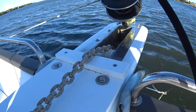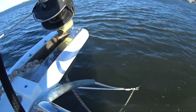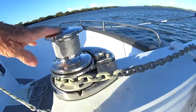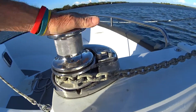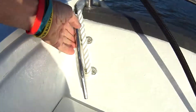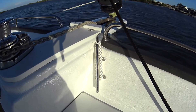That's going to work pretty well. That snubber is protected by these pieces of hose on the rub points, so we won't get any chafe there. All the weight's taken off the chain gypsy - there's no weight there. The weight of the anchor is just transferred up onto these cleats. Beautiful.